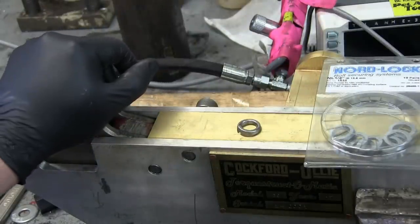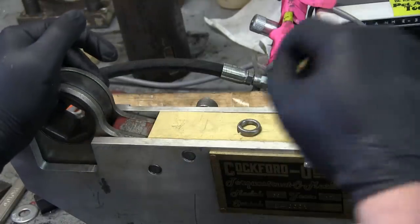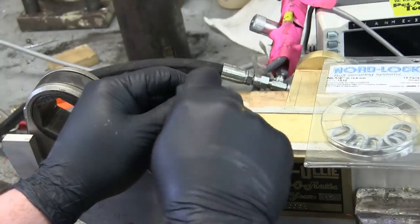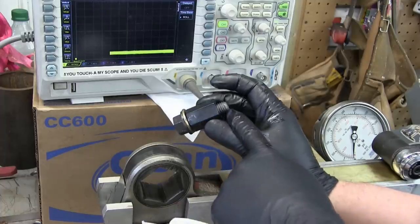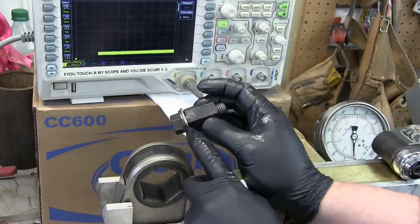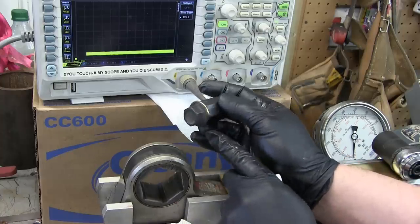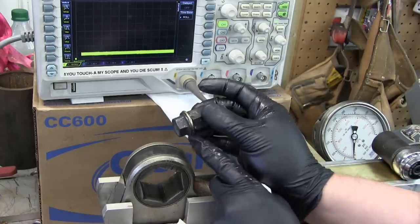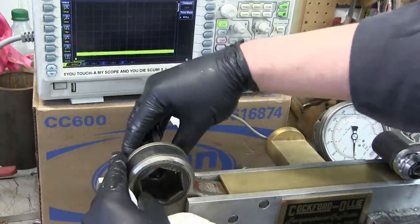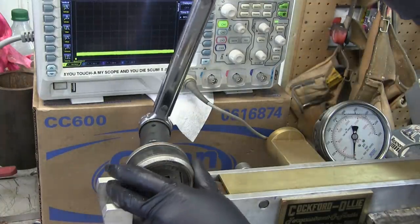Generally checking a nut or a bolt. In this case we're gonna do it sort of in a roundabout way. We're gonna tighten up fasteners, and then we're gonna see how much torque it takes to loosen the fastener off. First off, I've lubricated the threads and avoided lubricating the mating surfaces. We're going to just test a flat washer. This is a stand-in for our steel plate that the bolt is threading into. This is a skirted bolt, so the washer-looking thing is actually part of the head. We'll go in here and torque it to 100 foot-pounds and see what value that gives us. It should be right around 700.